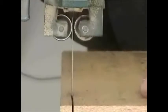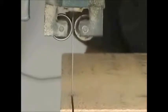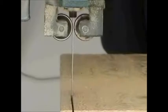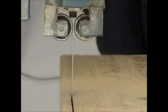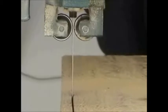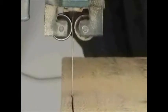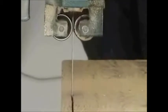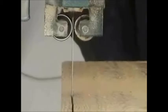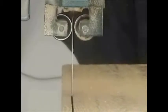They're set so the blade is just resting lightly against the left bearing. Now watch this entire cut closely, and you'll see the blade never changes in that alignment — it stays right there. But now watch the back edge of the blade as it works its way through. If you can see the thin streak of shiny blade down in the kerf, you can see it swaying from side to side as it crabs through the various cross grains in the wood.